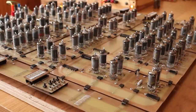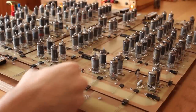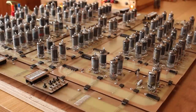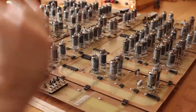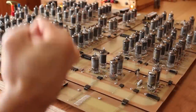So as part of the initialization process, I don't have a good way of clearing both of those at the same time. So instead I do an operation of 0100. I set the data to 0. This forces a 1 into the result register and forces a 0 into the carry register. So we'll clock that into the instruction and then we'll do the clock there, and I could see that both the carry register and the result register transitioned on the falling edge, so our bodge wire is working.